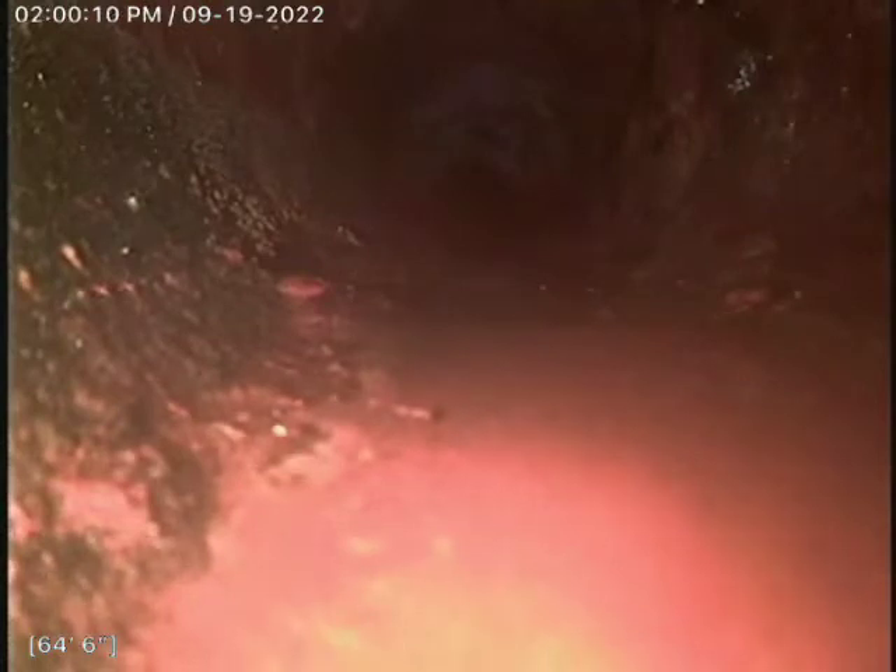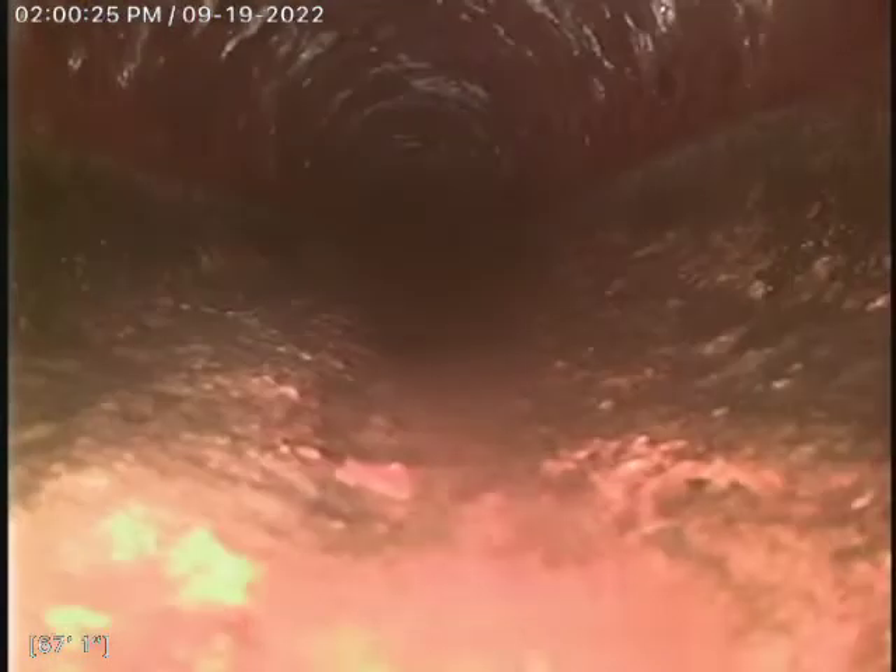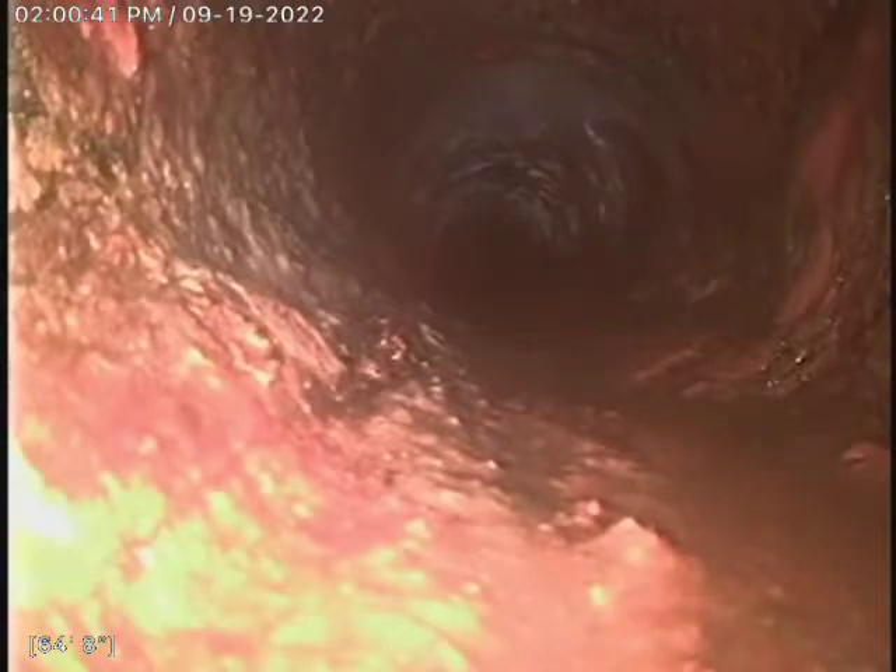That area looks kind of bumpy a little bit. Like I said, I ran my machine and went through it twice actually, with lots of water running. Pushed out all that scale that broke off the pipe. It's kind of a bumpy pullback because of how tight the cable is right now — there's all these bends and stuff. Trying to go as slow as I can.